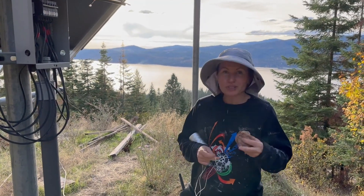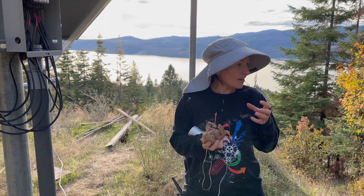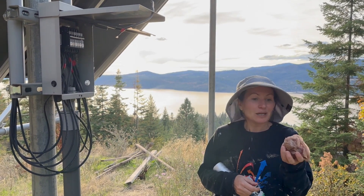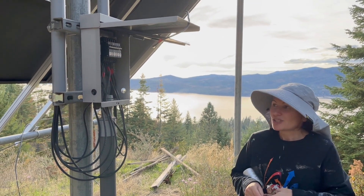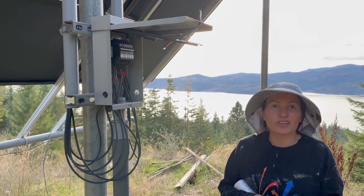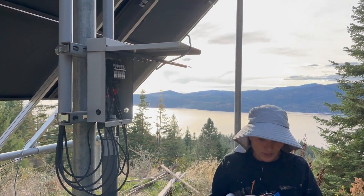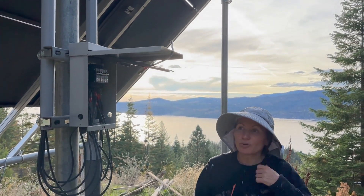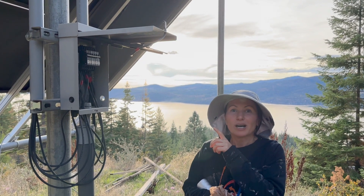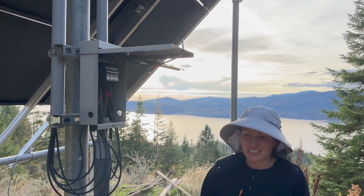We will use this first — a string that has to go in. This is the lightest thing because a vacuum down the hill has to pull it. We used the lightest string we could find and a plastic bag so that it has the volume. We'll put it inside the pipe here and down the hill, we'll suck it up with the vacuum. Then once the other end of the rope shows up, we'll pull it, and then we'll pull a heavier, thicker rope with the string. And then once the rope is in, we'll pull the actual wire with the rope. It's a three-step process, but shouldn't take long. Let's start.